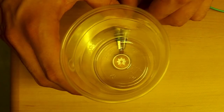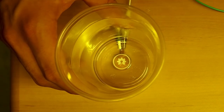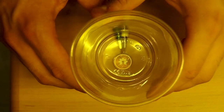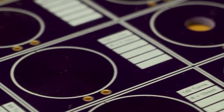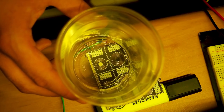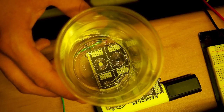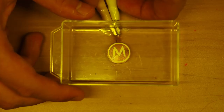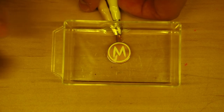I also tried testing the speaker with a 1.6 millimeter rigid PCB by connecting the magnet to the diaphragm. This was just a proof of concept, but in reality there needs to be much more calculation and tuning to match the resonant frequency of the cone with the PCB coil. I also tried amplifying the sound by connecting the flexible coil to different objects.